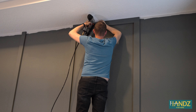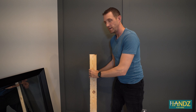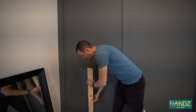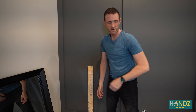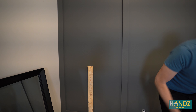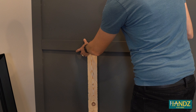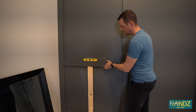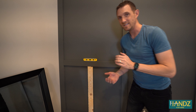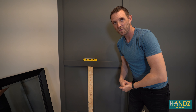We made some really good progress today but I'm going to call it a night — it's about nine o'clock and kids are trying to sleep. We did make one little mistake — the wall was 18 feet one inch, so we just added that extra inch to the center. The only issue is that my horizontal boards I cut are now just slightly too short. Tomorrow we're going to tackle that — I'll have to cut four custom boards to fit in the middle, but everything else should be pretty good.